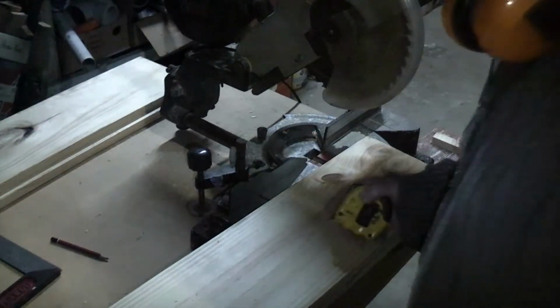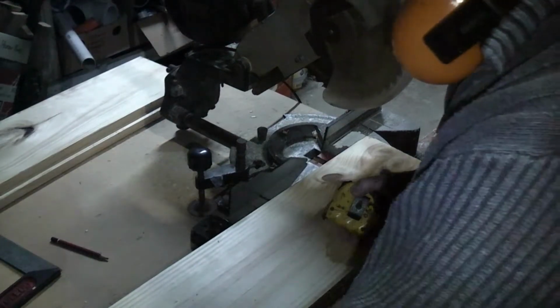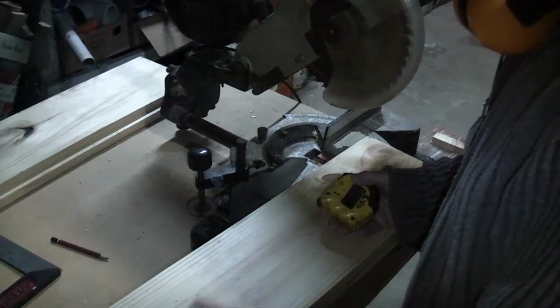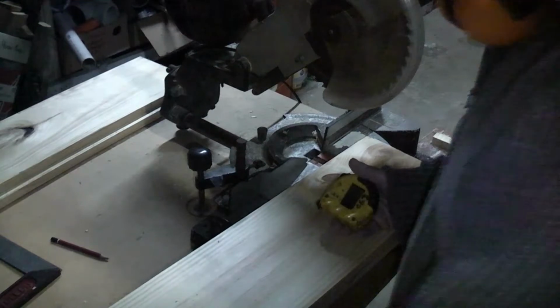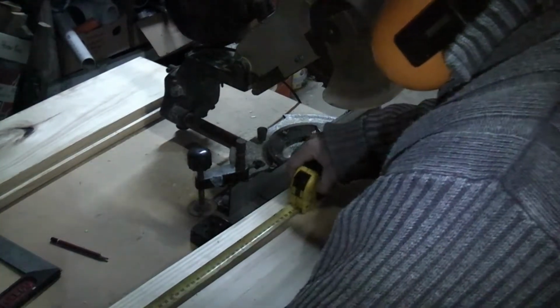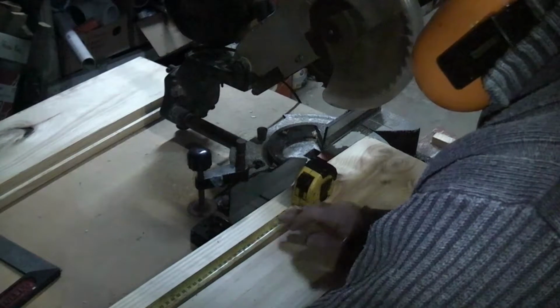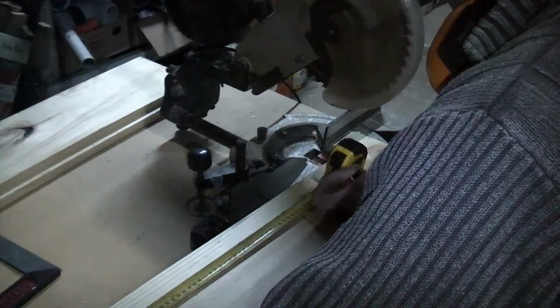Okay, now that we've squared up the ends and cleaned them up, we can cut all the pieces to length so they fit together nicely. You'll need 2 by 600 and 2 by 900 minus the thickness of the 2 other boards. So we make those 860. I know you'd say 19 is 38, but we go for 40 and it works out a lot better anyway. So we'll mark our 600 on these.